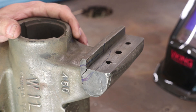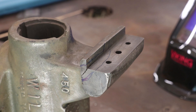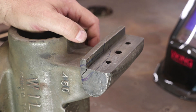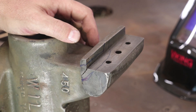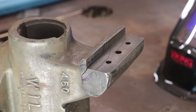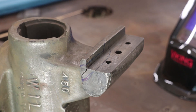Why not weld it? This is cast iron. I'm not going to say welding cast iron is impossible, but it is a little bit tricky - it takes some special equipment to actually truly weld it. But brazing is a pretty common way of doing it. The difference between welding and brazing is that welding, you're actually melting all the metal together. With brazing, you're putting a filler metal in there that binds to everything and holds it together very well. In our case, we're going to be using some silicon bronze. I'm going to be brazing this, but instead of the traditional way with a flame torch, we're going to use a TIG torch to actually do the braze job, which is kind of a new technique for me. I've been doing flame brazing for many years, but I recently picked up a TIG machine and we're going to give this a try. I've done some practice on cast iron and this is really my first real job, so hopefully everything goes good.